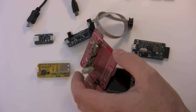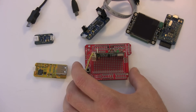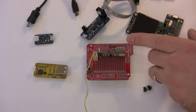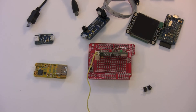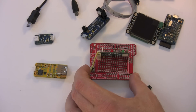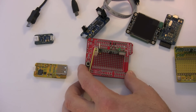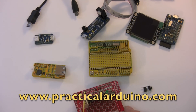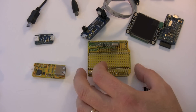In the case of some designs, what we do is begin by prototyping the circuit itself on a prototyping shield or something similar. Sometimes you can build it up using discrete parts — in this case it's got some regular through-hole parts and a module. This is electrically quite a simple design, and what that does is allow us to validate that the design works as we expect. In this particular case, this is a 433 MHz receiver — a project from the book Practical Arduino. Once you are confident of the circuit, you can lay out a PCB specifically designed for that purpose.